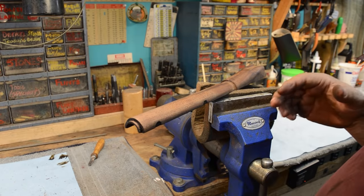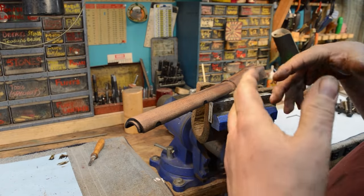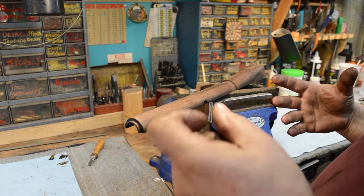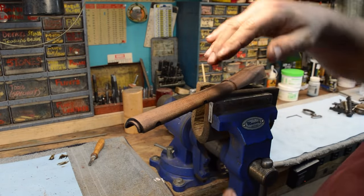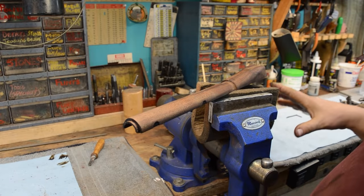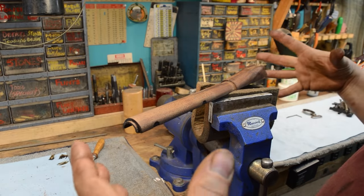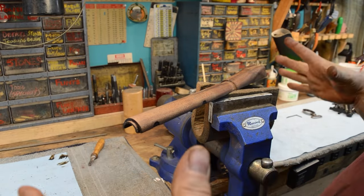But at the end of the day, there is no such thing as a totally waterproof finish unless you're in one of those West System epoxies that make it look like it's sitting under about a quarter of an inch of water. The issue there is the wood then moves and you get all those little cracks like you get on the Brownings with all that urethane. Oil is nice because it can be fixed. You can dent it, you can fix it. If you craze it because you're steaming up dents, that's great.